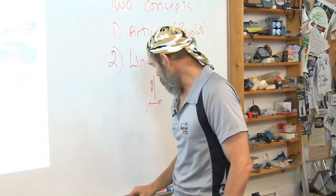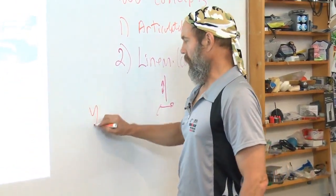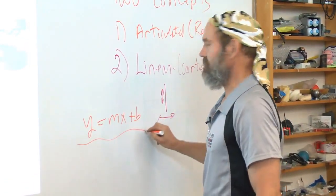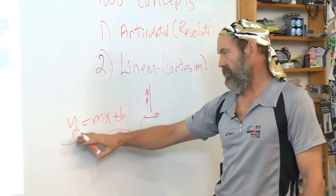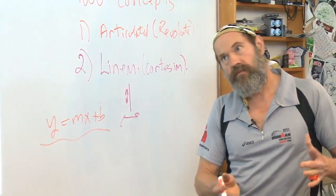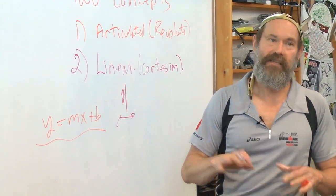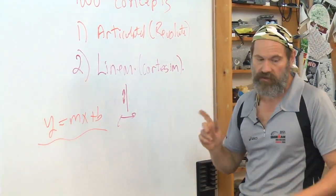So you always start identifying the things that may go wrong through experimentation. Because when you do a nice linear model — y equals mx plus b — there are no instabilities in there. But if you've modeled something with a simple linear idea and it's got a nonlinear term you didn't model, you won't discover it until you build and release the product and things start coming back. That's why you've got to identify those unmodeled nonlinear terms during experimentation.